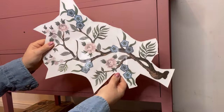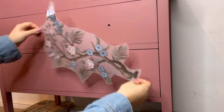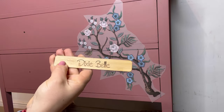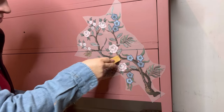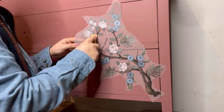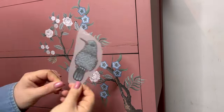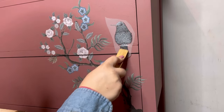Now I've decided where I'm going to place the transfers. Make sure that you're certain on placement before you apply, as you won't be able to alter it once it has adhered. Remove the white backing sheet and then gently press down to keep it in place. Then using your wooden burnishing tool you simply need to rub over the whole piece, burnishing it onto the paintwork. Before removing the clear sheet I always run along the drawer edges with a Stanley knife — this will cut the transfer and allow the drawers to open. You can build up the design by adding the different sections where you want to, and once it has adhered to the paintwork you can carefully remove the clear sheet.